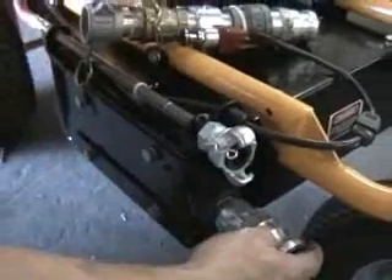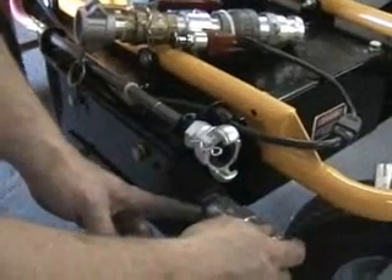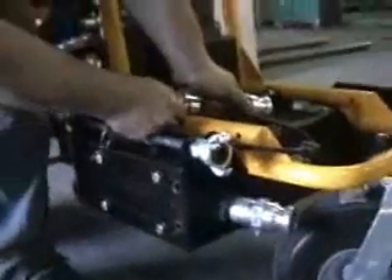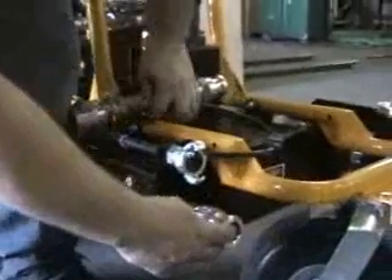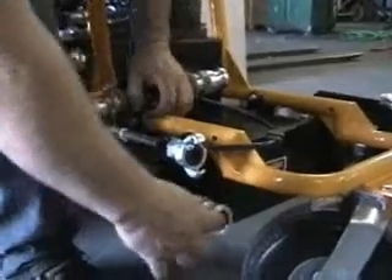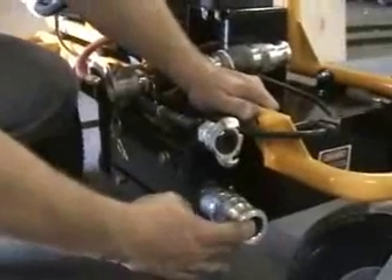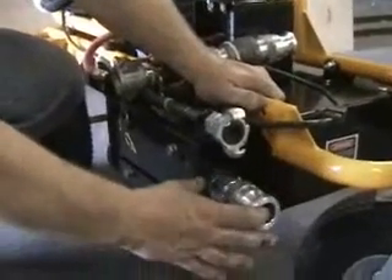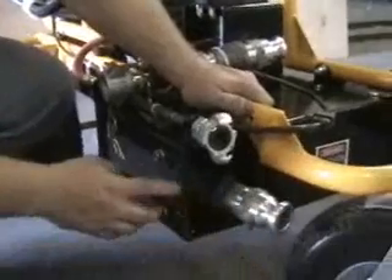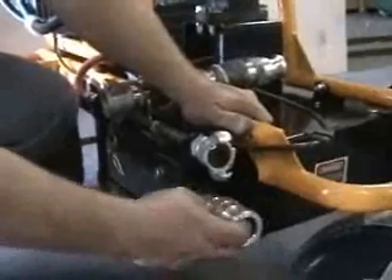Use the machine to pull the hose back and stop it right at the edge of the fitting, then reassemble it. It is very important that this fitting is flush with the machine itself — otherwise the hose on the back side of the rotor will get flattened and cause problems later on.